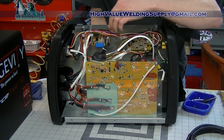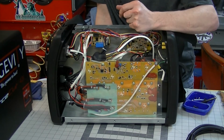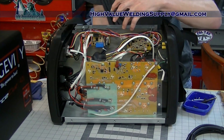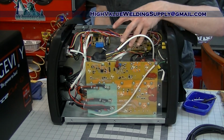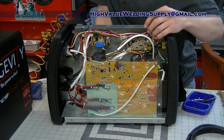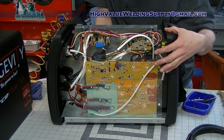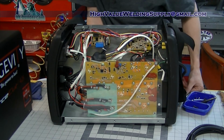Very, very nice. Everything has been potted, and what that means is, you see this red Permatex-looking gunk here? If you have an electronic component that is potted, that means that it is filled with some type of resin or a rubber gasket material or something that keeps vibrations from being able to tear it up. Keeps oils and chemicals out. And so everywhere where a transistor or something mates to the board here, it's got potting material around it. So it's got its soldered connection, but it also has an actual glue, an adhesive, something that resists moisture buildup. Really a nice way of doing things. You can look, it's got multiple noise isolators there. You don't see that in a lot of your lower end stuff.